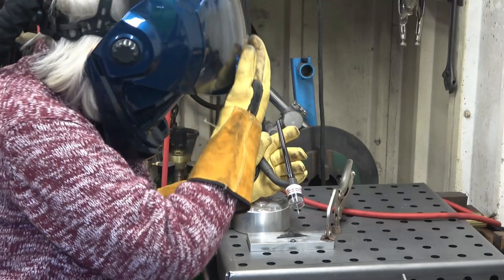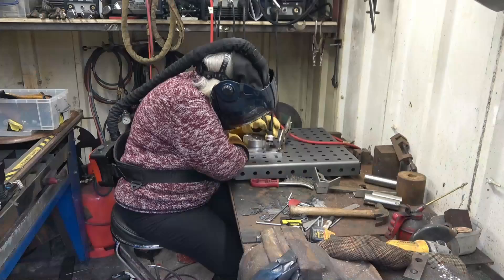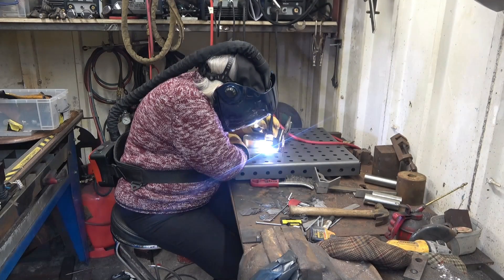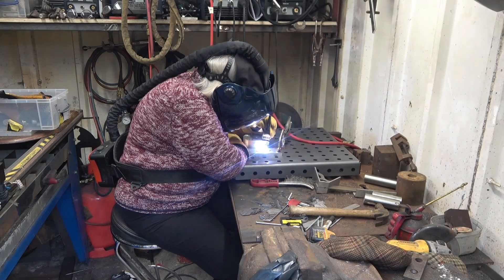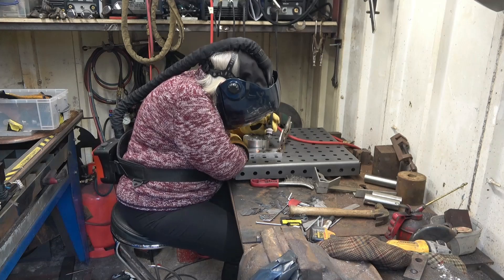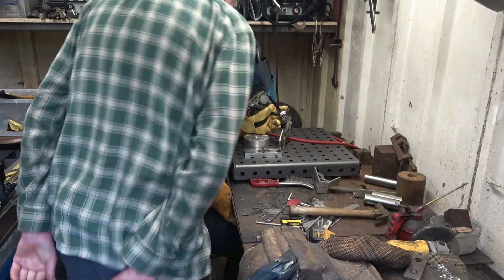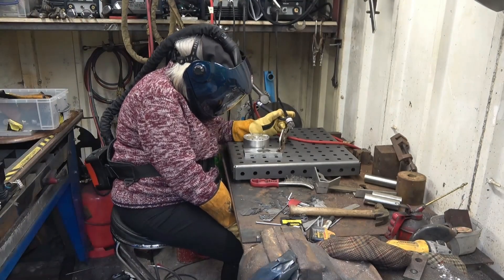You must keep that torch still at the end of the weld. See there's so much colour change there. Am I doing that on the same blade? Keep that torch still once you've finished the weld. When you get to the end of the weld, keep the torch there. I'll tell you what — if you hadn't moved the torch, that would have been perfect.